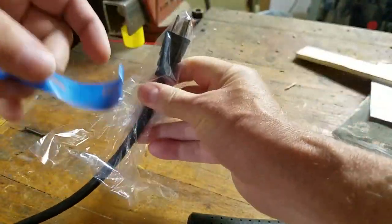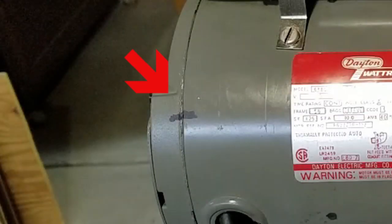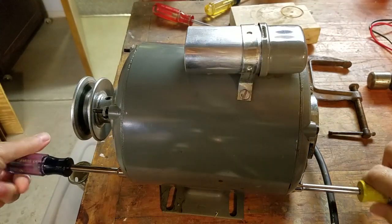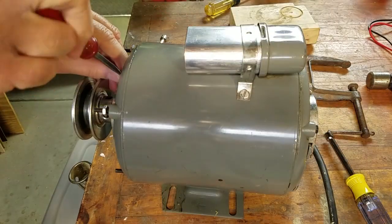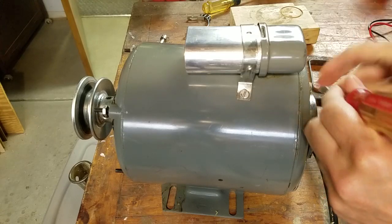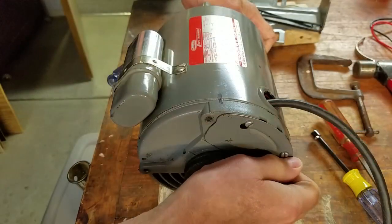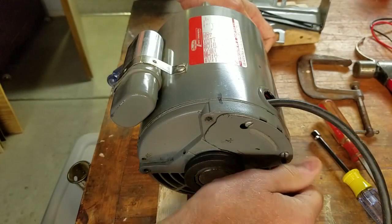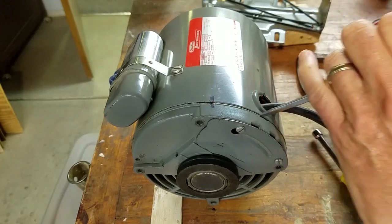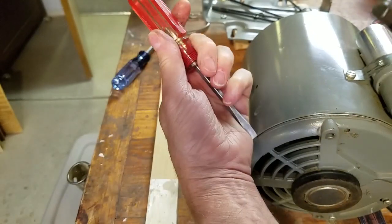Before we work on the motor, tape a bag over the plug so we don't inadvertently plug it in. First thing to do is to mark the relative location between the end cap and the motor frame. Then loosen the nuts on the four long screws that hold the motor together. It's much easier to do it now while the motor is still on the base. Then remove the clamps that hold the motor to the mounting base and lift off the motor. Now remove the four long screws and then tap the rear end bell off. Be careful since things can pop apart suddenly and either fall or break.